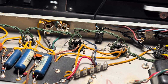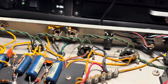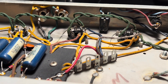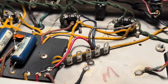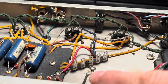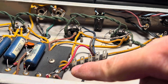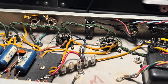If you get the wrong ones, they're going to start conducting at the wrong time. You're going to get some nasty distortion and they're going to wear out really quick, and that's a headache you don't want. So I'm going to mount them up, then we'll get your plates connected, and then we'll go ahead and put the junction over here to where the B+ is coming in for that supply.